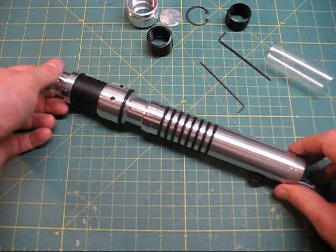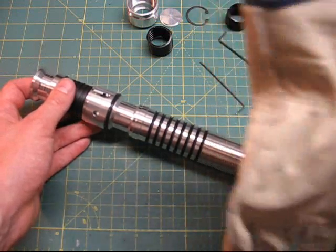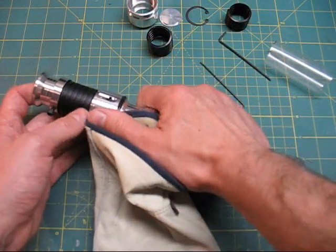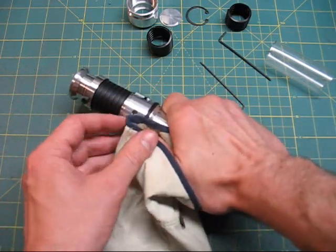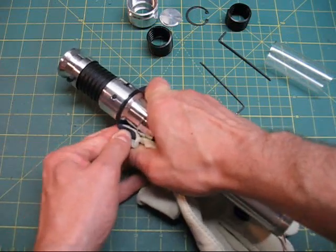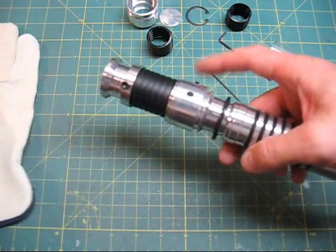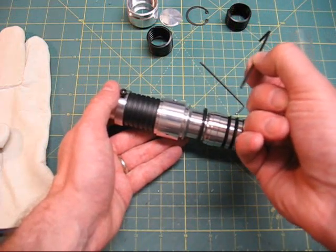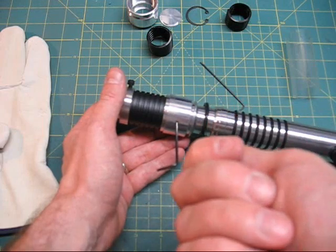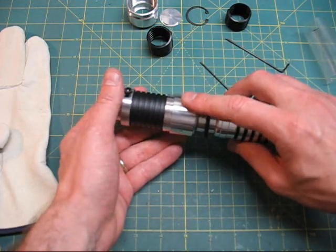Now this is where the fun starts. This collar piece comes off to get access to the switch and all kinds of other goodies. I'm going to use a leather glove — just put my thumb in to give me grip on this rubber O-ring so I can slide it off. The leather should be enough grip; it's a pretty tight fit. Now I've pulled off the O-ring. This collar is still held securely — that's where we need our 5/64th allen key. It goes in this tiny hole right here. There's a set screw in there, and what I want to do is tighten it clockwise one full turn. That releases the tension it was providing on the collar, and the collar slides off.